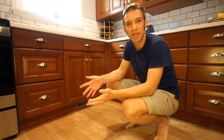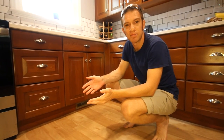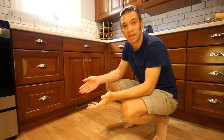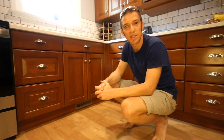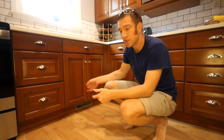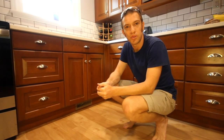I was actually a little bit nervous about this part of the project because I didn't realize we could just do a color match for the stain, but straight from the store the color worked out pretty well and we only had to modify it a little bit. The most difficult part was matching that contour of the floor. Toe kicks are a pretty underrated part of your kitchen, but if you mess them up it'll really stand out, so it's important to do a good job. If you have custom built cabinets or something you're piecing together, make sure they match everything. In our case it was actually cheaper to build the toe kicks ourselves than to buy them off the shelf. And if you have a jigsaw it might make the vent cutout a bit easier, but as you saw in today's video, we could do it with just a hand saw — don't let the tools limit you.